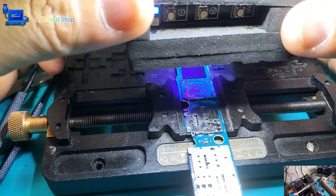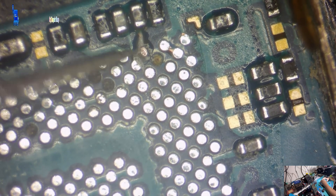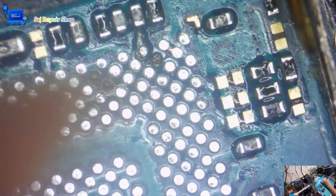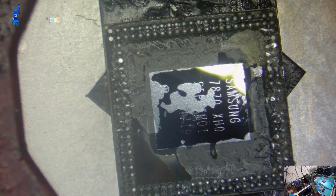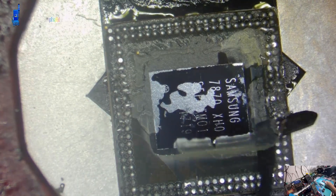After the jumper wire is in place, it is important to cover it with a layer of UV glue to secure it and protect against any electrostatic discharge, which could cause further damage to the device's CPU. This repair process will ensure that the positive line is reconnected and functioning properly. This next part is about cleaning the CPU and ROM. Since the CPU is thinner, it requires delicate and quick cleaning.